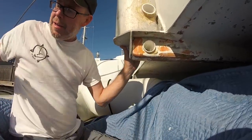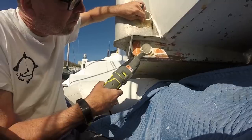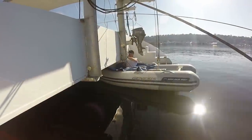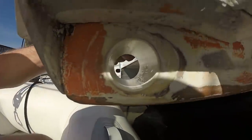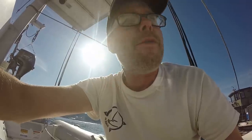Lynn's mixing me up some epoxy — it's gonna kick in the sun, so let's go. I've buttered the inside, inserted the tube, and then injected thickened epoxy from both sides. The inserts are all epoxied in — we'll let these fire off tonight and sand them smooth tomorrow. These fired off overnight; I trimmed them flush and sanded smooth. The sleeves are all ready. Now it's just a matter of positioning that long tie bar on the deck and threading it through — it has to go through five different holes in the boat.